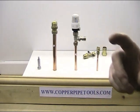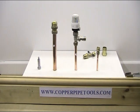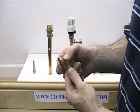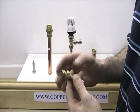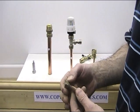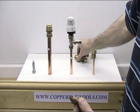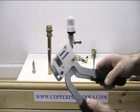What I want to show you next is how to remove a 10mm olive from a pipe. What we've got here is exactly the same thing - nut, olive, pipe - except the size is 10mm. It's very rare that you want to pull these off, but sometimes in certain circumstances you don't want to cut the pipe - it's a little bit too short or whatever. These can be just as tight as a 15mm. This thing here will only do 15mm and 22mm if you're lucky, so I'm going to show you how to adapt the olive pull-off tool to do 10mm.